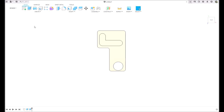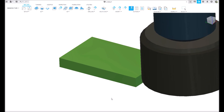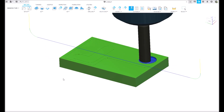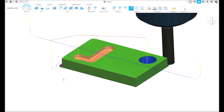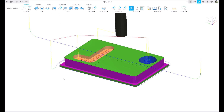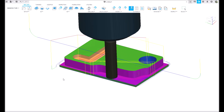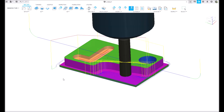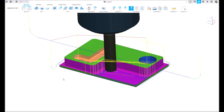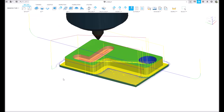So let's go into Manufacture and we'll CAM this out. The first setup here: first the facing operation, our boring, then we're going to do our slot. There are some adaptive clearing, a contour, and last we're just going to break these edges off.